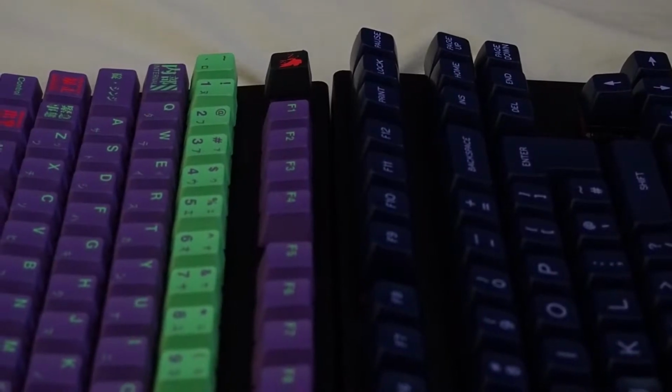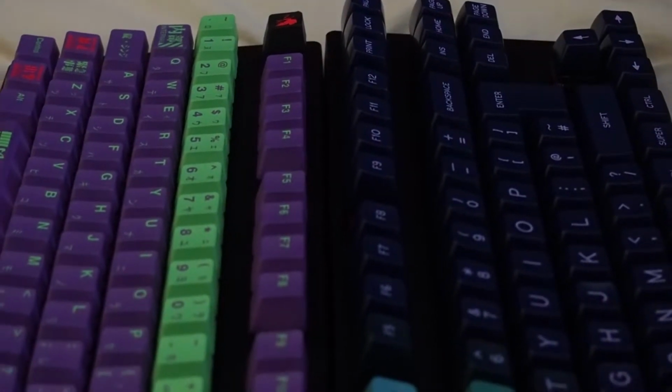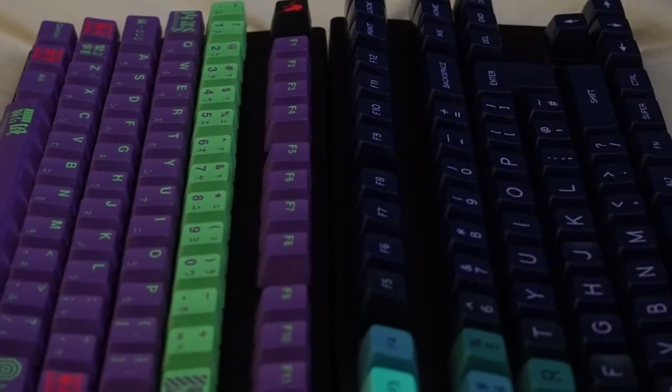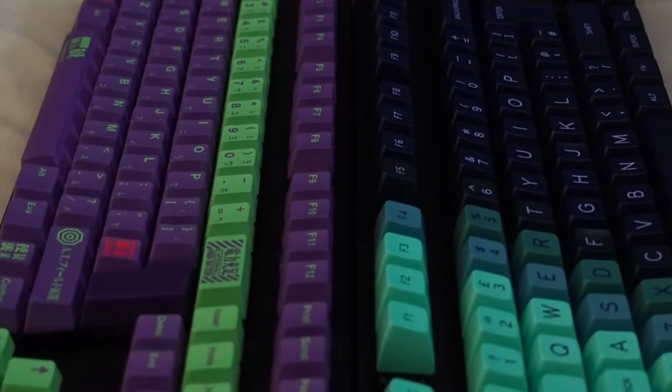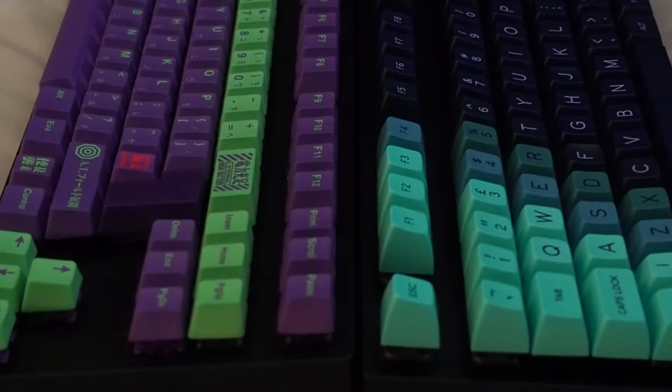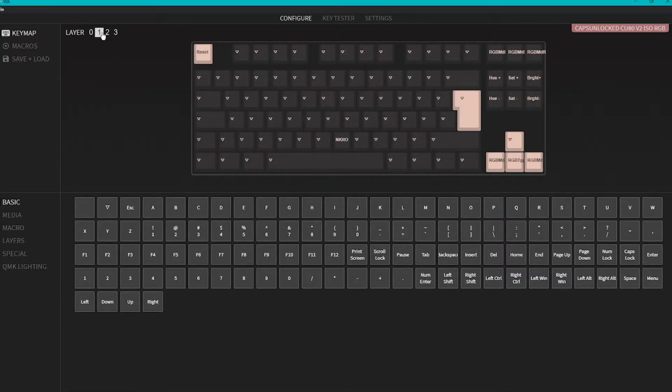The board itself is 10 keyless, otherwise known as the 80% layout, which is where the CU80 gets its name. You'll be seeing no numpads here. The PCB from round 2 onwards is an ISO layout hot swap board with SMD RGB LEDs. These are per key and fully configurable in QMK. While you can get the board to work in VIA for layer management and sorting your macros, currently the lighting tab is disabled in VIA for this board, so if you do want to get more in depth with your lighting profiles, that'll be a job for QMK.